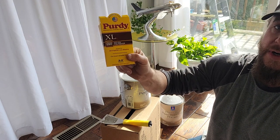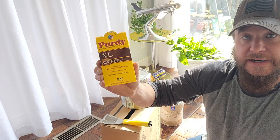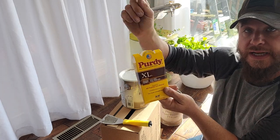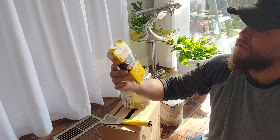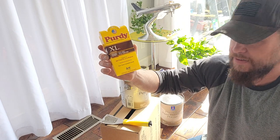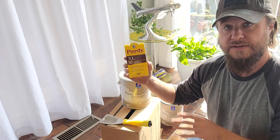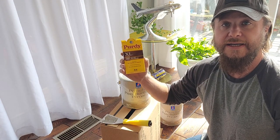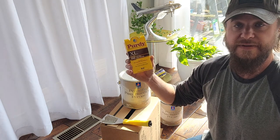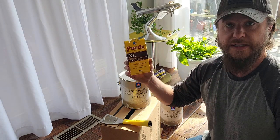Here's my brush — this is a Purdy brush. Medium stiff. This is a 3-inch. I can cover a lot of area with this, but it's still small enough that I can get into corners and even do trim around windows. The medium stiff is important for use with this product, the Peel Bond Primer. The medium stiff bristles flex and get down into nooks and crannies, crevices, cracks where things are peeling — which is the whole point. Even gets into pinholes. If you use one that's too soft, it's just going to slop around and you won't be able to get those bristles into the crevices.